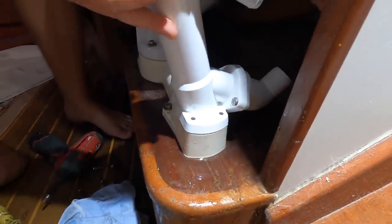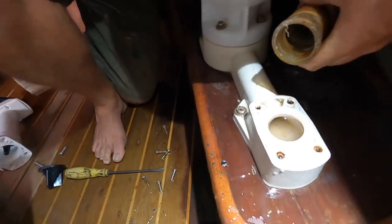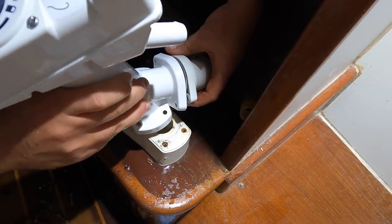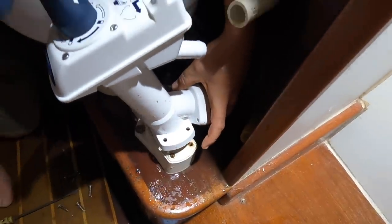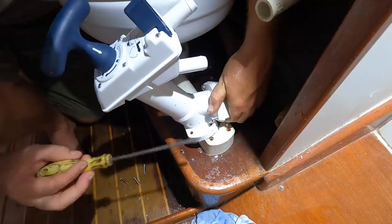It's a match — I can see the holes. There are two options for repairing these Jabsco-type toilets: either a gasket kit, which only includes the little rubber gaskets, or the entire pump assembly. The entire pump kit usually only seems to cost around 50 bucks more than the gasket kit, so it's usually worth getting the whole thing rather than just the tiny little rubber bits.